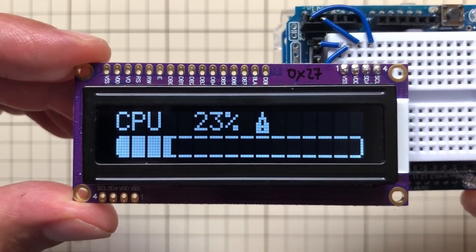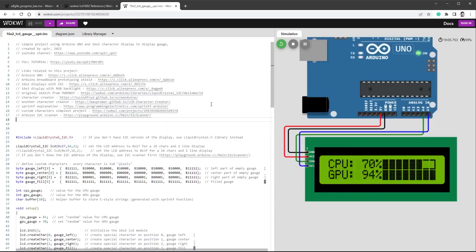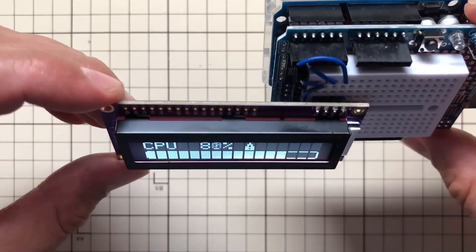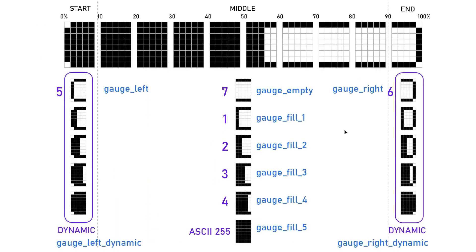We've got a few tools and tips before you go. First up is this smooth Arduino gauge on a 16x2 matrix display by Upeer. 16x2 displays are generally pretty cheap for a large-format display, but it's hard to get them to display a progress bar. The real trick here is creating a custom character set so you can have all the elements you need to create a smoothly filling progress bar. If you've ever wanted to extend the capabilities of one of these displays, check this one out.